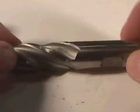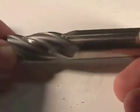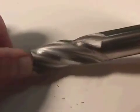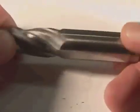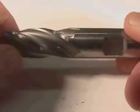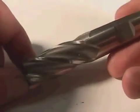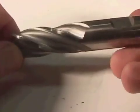Let me talk a little bit about what end mills are made out of. This silver colored end mill is made out of a material called HSS, or high speed steel. This is one of the most economical, general purpose end mills you can purchase, capable of cutting many sorts of materials — mild steels, aluminum, etc. But if you are machining a difficult-to-machine material like stainless steel, you may have to move to a tool made of something else.